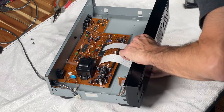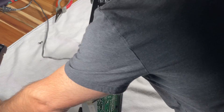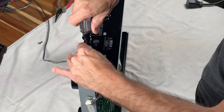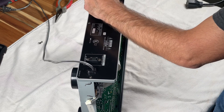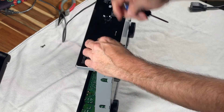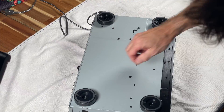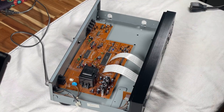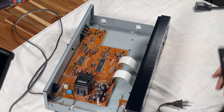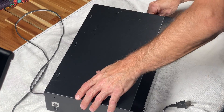Now I'm just reassembling this back in the same order that I basically took it apart in. Doing the AC outlet first — it screwed in much easier this time; getting them loosened when taking them out made it a lot easier. I did the RCA jacks as well. The transformer goes back in, that also aligned — I was surprised. I made sure those little feet fit in there too. And these are the spectrum analyzer ribbon cables going back in. Now it's time for the case top — screw it back in just the same way you unscrewed it.